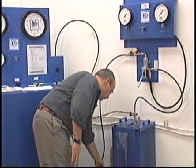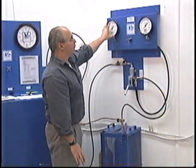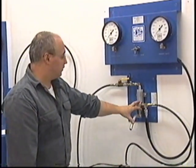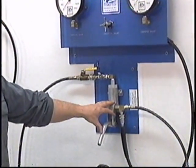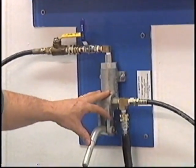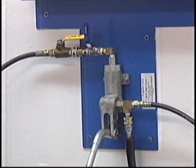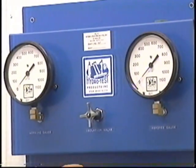You must have in-house calibrated gauges accurate to a readability of 1% at the test pressures. The test pump that most already have is okay to use, as long as you understand that these pumps were really not designed to hold pressure as accurately as DOT is now requiring. Therefore, you may have to put an outlet check valve as a separate item on your outlet line.